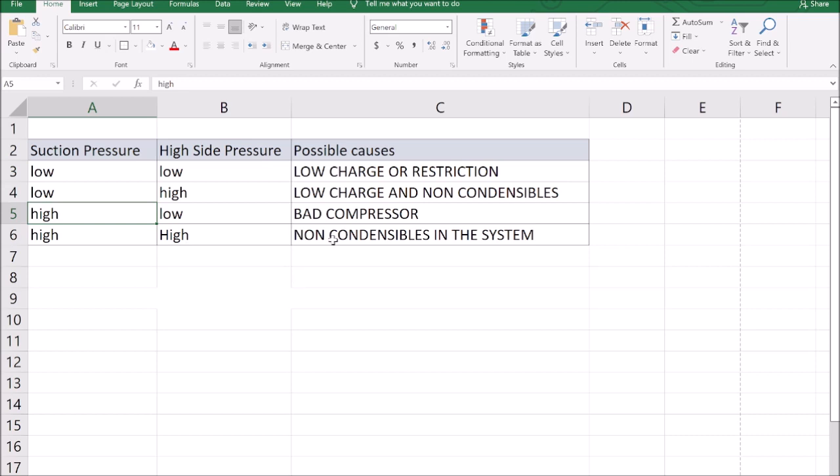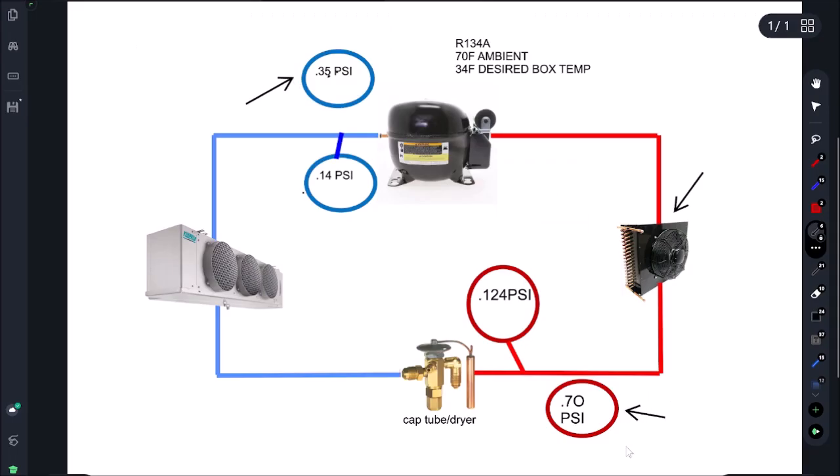The more common misdiagnosis I see is high suction and low head. People confuse this for low charge or a restriction. If we have a restriction, suction will be below 14 psi with a correct charge. Even if you try to overcharge the system, the head pressure may go up but the suction will not. From equalized at 60 psi, suction should pull down to 14 — if it's staying at 35 that's no good. I like to pull the charge, put it back in, and observe: if starting at 60 psi the head isn't ramping to 124 and stays at 70 with good charge, the compressor valves are bad.